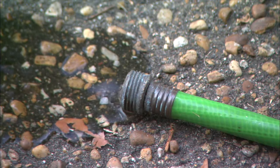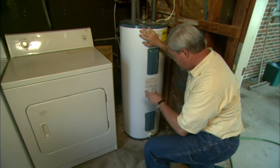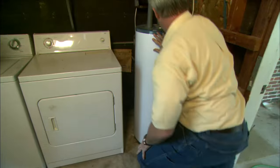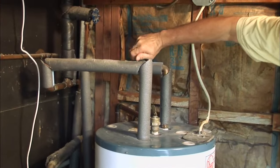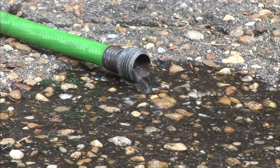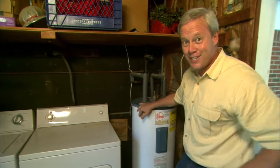It'll take a little while — this is a 30-gallon water heater. Once it's completely drained out and the water stops coming out the other end, turn the supply back on and it'll really flush out the last little bit of sediment you may have in the bottom. This is real easy, doesn't take very long, but it'll make your water heater last a lot longer.